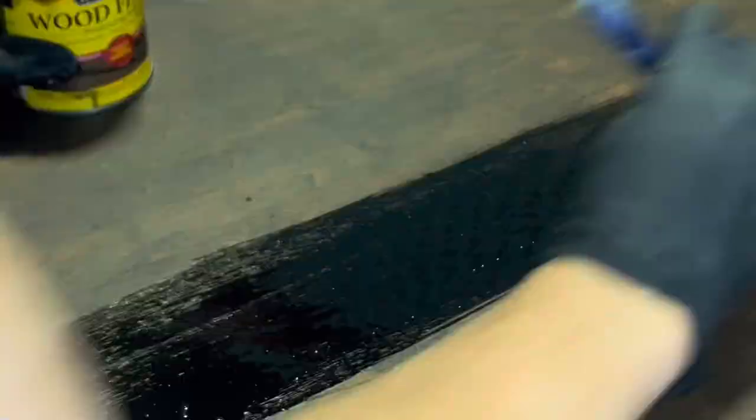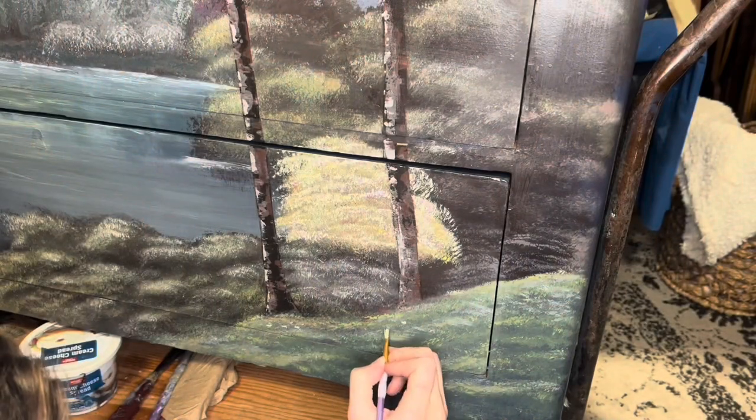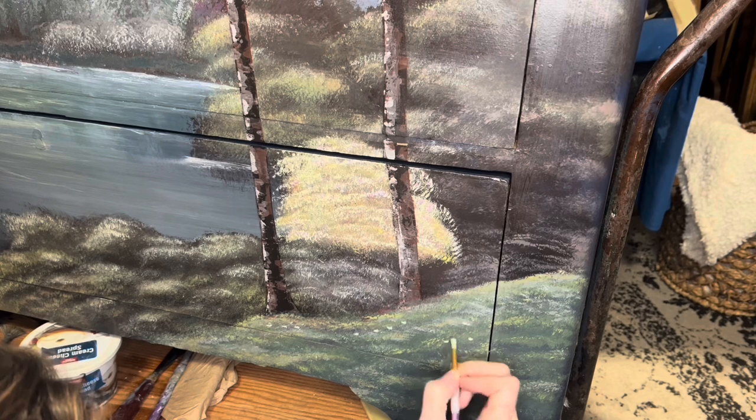Now I'm going back to the top here. Again, I needed it to be better. So this is the other stain that I ended up using. It is black. It doesn't come out black. It still looks brown when you're finished. It's just a really, really rich brown. It's the oil stain. You can see it automatically works way better. So I just needed to do that.